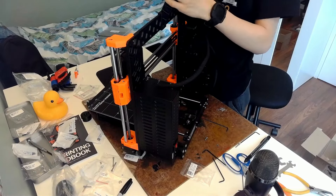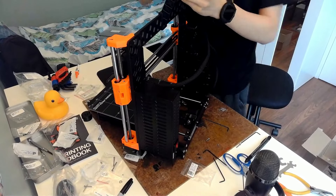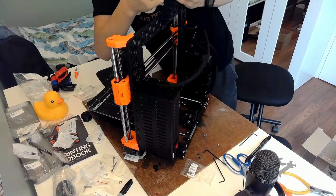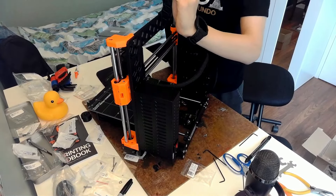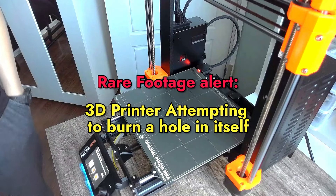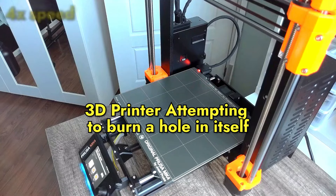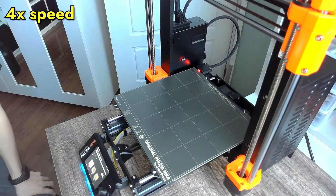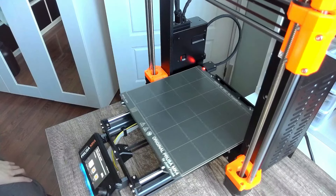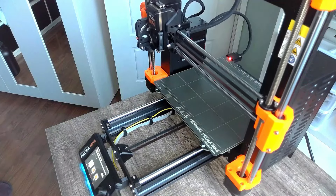After I finished assembling the printer, I decided it would be a good idea to try and test print something, to see if the printer actually worked and to make sure I didn't make any fatal flaws while assembling it. The slicer that I used was a cloud slicer, but it must have been a low-quality one because it corrupted the file somehow, and the printer tried to burn a hole in the print bed. I had no idea what to do at first — I didn't even know it was the sliced file until I properly sliced it on the Prusa slicer and learned that it was the software that was the problem, not the assembly. I would recommend using one of the provided files rather than one of your own sliced files to test the printer for the first time.